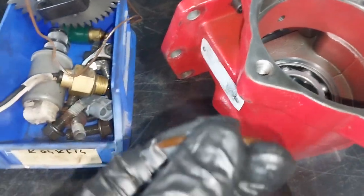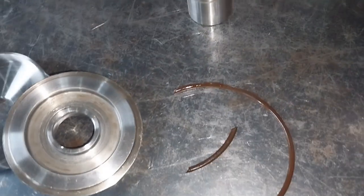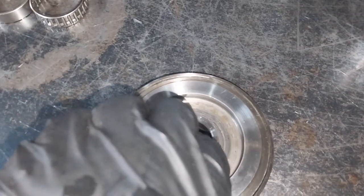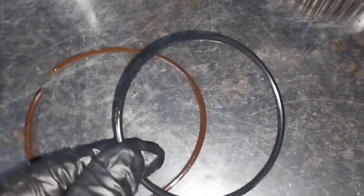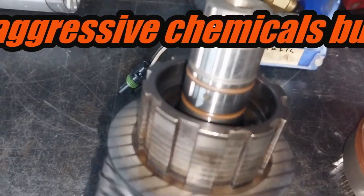I found this little piece of o-ring just floating around in here — we're wondering where the hell did that come from. With a bit of research and looking at some manufacturer's drawings, I actually found the piston that creates the friction. But obviously it was never creating really good friction because this o-ring was in two pieces, not one piece. This is Viton unfortunately, which means tracking one of these down at that size may be a bit of a challenge. I know we're on a tight time frame, but I insist we try and get a new Viton seal. You can also see Viton seals on the shafts there.